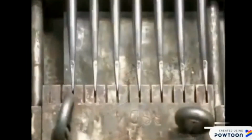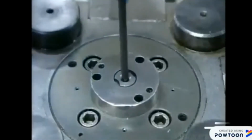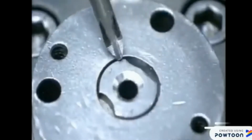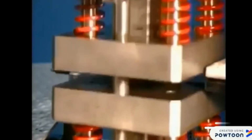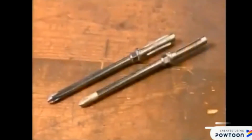Then they insert the screwdrivers into a different slotted device. Its tip has a beveled cross point to correspond with the Phillips screw. This machine carves ridges into the bevels of the cross point to give it extra gripping power. A press then slams into the other end of the screwdriver to create flanged grooves. These grooves will allow them to lock the screwdriver shaft into its handle. It's time for some positive vibrations. This vibrating feeder causes the screwdrivers to chafe against each other, and the action removes any waste material.